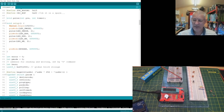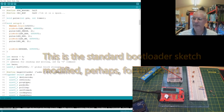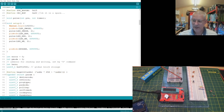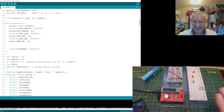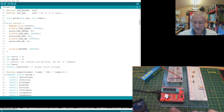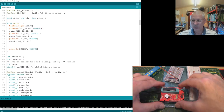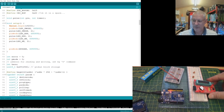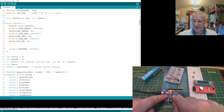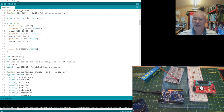So we're back to COM 22. Let's fire up the Arduino IDE and go over to the code window. Here is the code that comes with this board - there will be a link on my GitHub and below this video where you can grab it. We're going to upload this sketch now. As a beginner, you might think there are two things going on here - one shield on top, one underneath. But at this stage we're just programming the underlying Arduino in exactly the normal way, uploading this sketch to it. Nothing to do with bootloading yet.